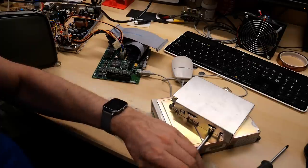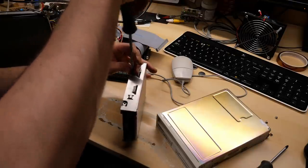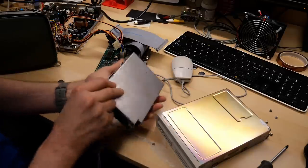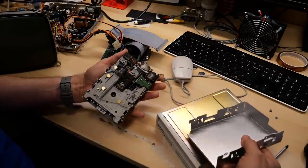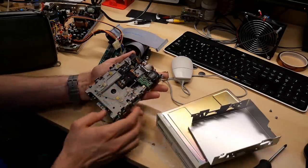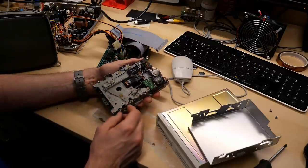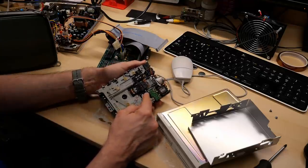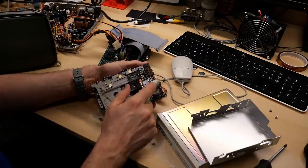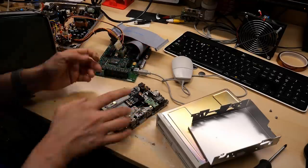Let's take a look at this floppy drive. I notice that the top cover on the floppy drive is from some other Macintosh — definitely not from the Classics, it's from something else. This thing is pretty clean, although it's missing the little metal cover that goes on the head. Let's see if this thing goes down properly. It doesn't seem gummed up actually — it looks okay. There's the jack screw for the head stepper assembly; it needs a bit of cleaning, but that's totally normal.